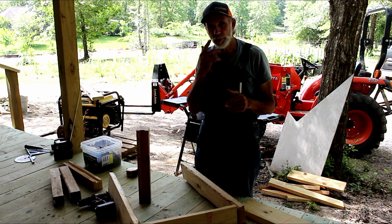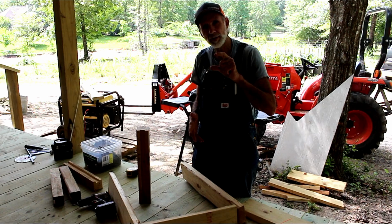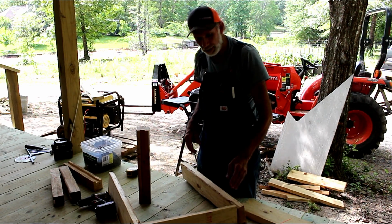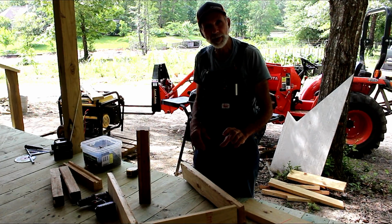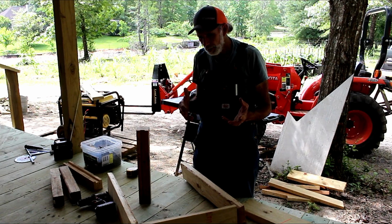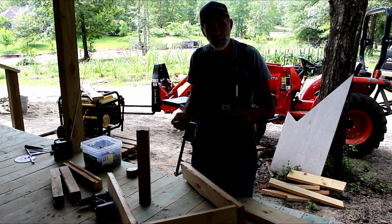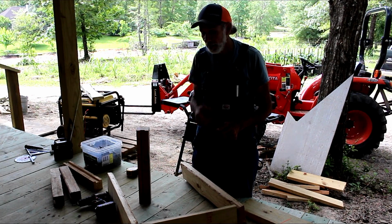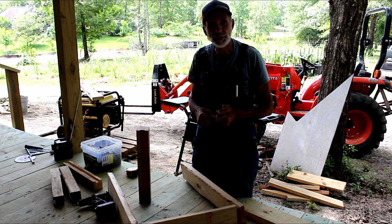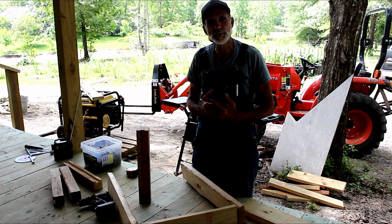So what I'm going to do is, as soon as this is built, I'm going to rip me some strips down about 2 inches wide. And I'm going to screw them all the way around the edges, let them stick up about 3/4 to an inch. That way, once I set my trays down in it, they can't slide off of this stand. They'll be permanently stuck there, and all the other trays just lock inside each other, so I don't have to worry about them moving. And we'll be able to stack a pretty good bit of Irish potatoes up in these things.